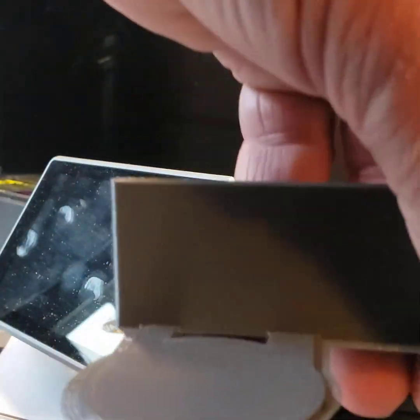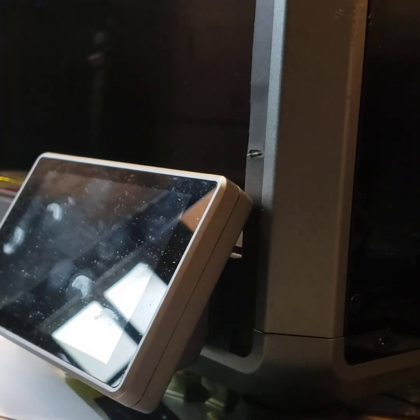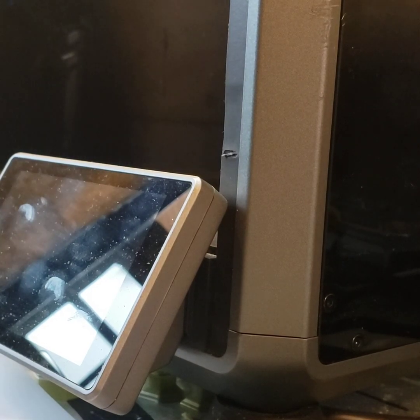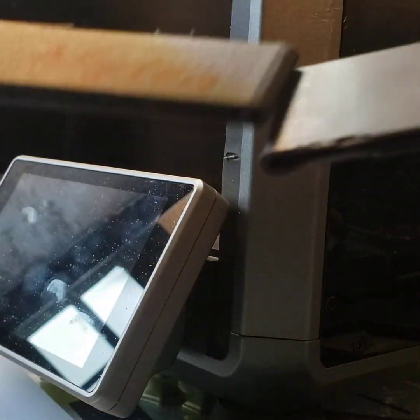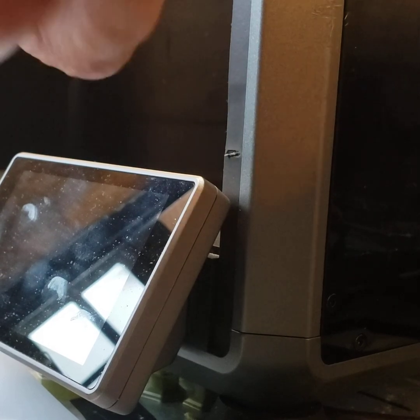Let's get a little elevation — here's our part. I'm just going to break the brim pieces off rather than cut them. You can see those just break off. I want to find out how rigid this plain nylon is compared to the carbon nylon. It's still pretty flexible and — I got a little crack out of that. It does feel stiffer. This carbon nylon on the other hand — no cracking, I can bend it all over the place, absolutely no cracking.